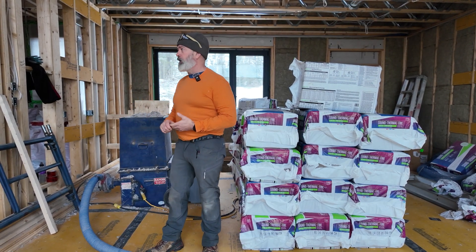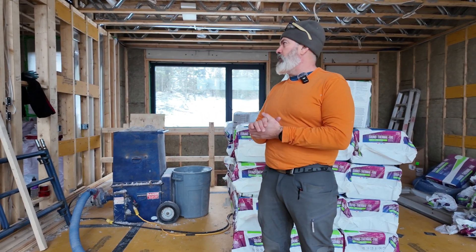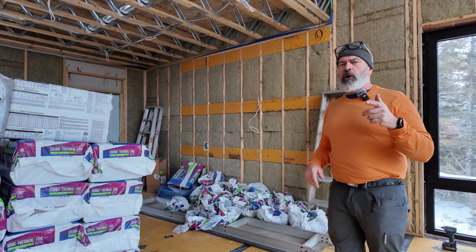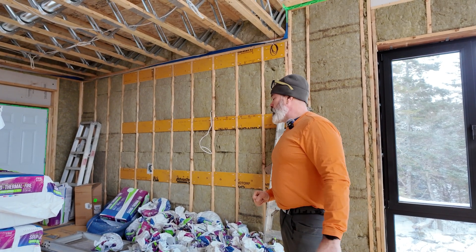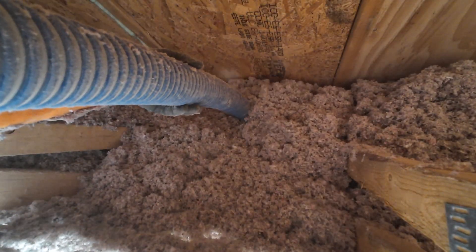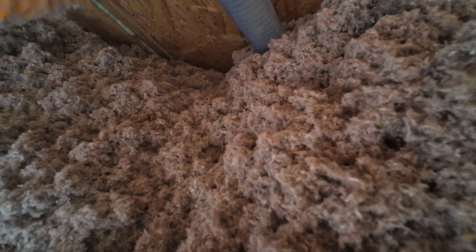It's been a little while since we did an update here. As you can see, all of our mechanicals are in and we're getting really close to completing our thermal envelope — less than a quarter of the attic space left to insulate. Yesterday we hit 129 bags of cellulose in our vented assembly. We have a truss with a two-and-a-half-inch vent chute over top of the cavity we're filling with cellulose. It's not a dense pack, but we keep the hose buried in the cellulose the entire time and try to shove it down as we go.